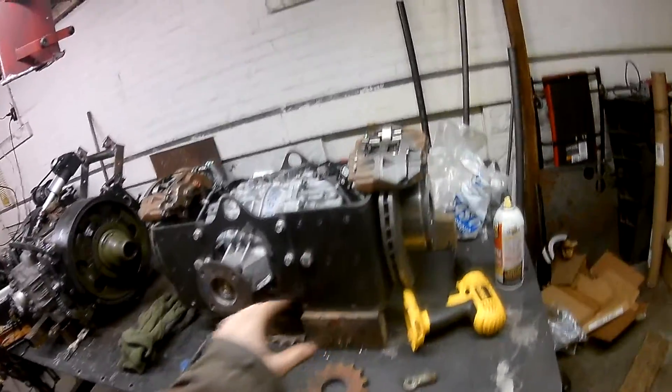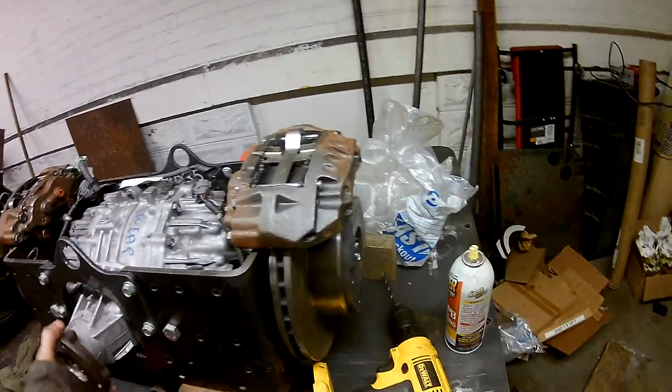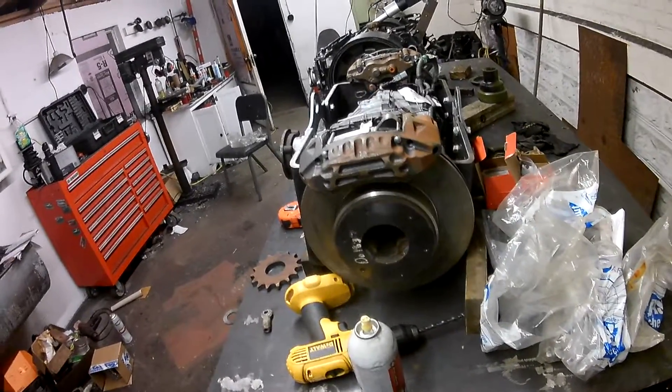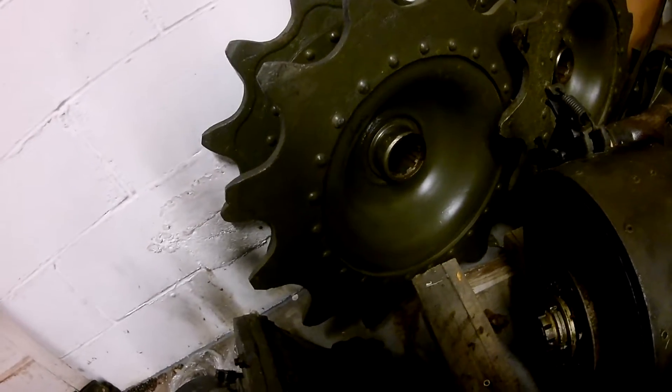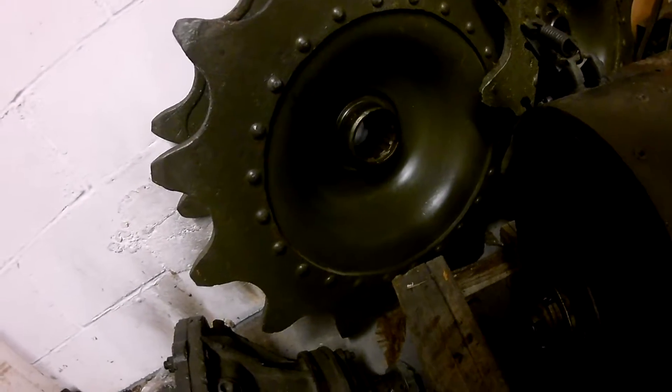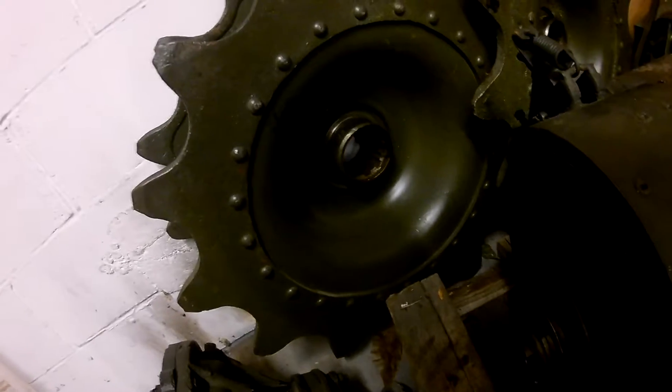To solve the issue of rotating backwards compared to most engine manufacturers, I imported some final drives as well, which gives me good leverage and good life on that Acura MDX axle. I also imported the sprockets — these were actually pretty cheap, about $100 USD. I don't think I could have paid a machine shop to turn those down for $100, especially if you're just making two of them.